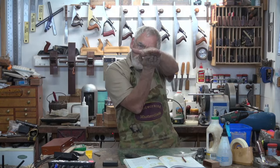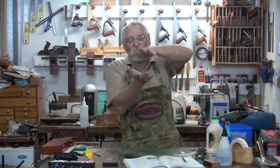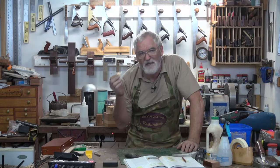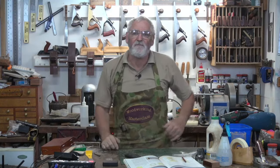Does the edge of the plywood sand much different from regular wood? Yes, it does. The reason being, when plywood's made, it's at 90 degrees, so you've got one sheet of veneer going that way, and then one sheet going that way, and then the top sheet. And if you look at plywood, it's always uneven numbers. It's either 3-ply, 7-ply, 9-ply, 11-ply, because the two matching outside pieces have to be the same orientation. So it does sand a bit differently. It definitely planes differently, because you're planing long grain and short grain at the same time. That's another reason you've got to have really sharp tools, especially with plywood. And it will blunten your tools quicker, because of the glue that they use. A lot of time it's a resorcinol formaldehyde-based glue, which is very tough on blades. So I hope that one helps you.